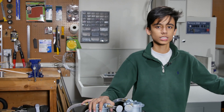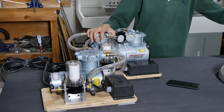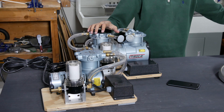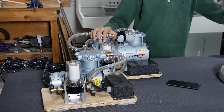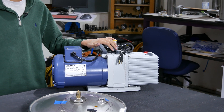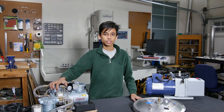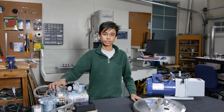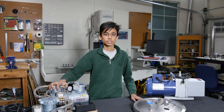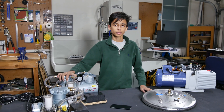For the vacuum tests, we used these vacuum pumps. They're rocking piston vacuum pumps that can create about a 96% vacuum, meaning they can remove about 96% of the air molecules from an enclosed space. For autoclave use, we have an oiled rotary vane pump. It can get very close to a total vacuum, but this style is much more delicate and doesn't like high humidity in the pumped air. Since we created a lot of humidity in the pressure vessel, and 96% was more than enough vacuum for this series of tests, we ran it with the rocking piston pumps.